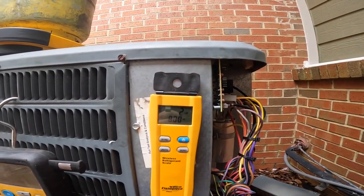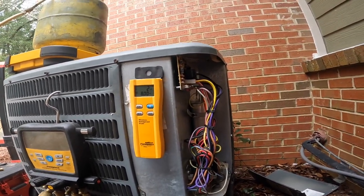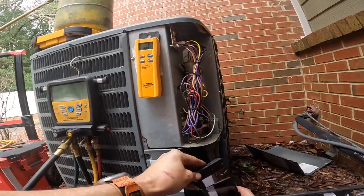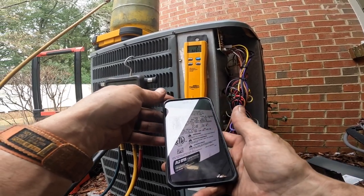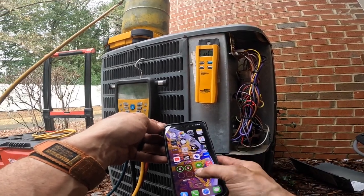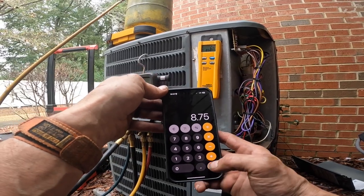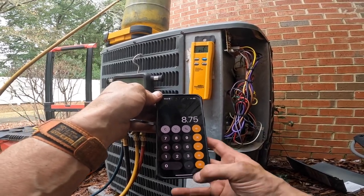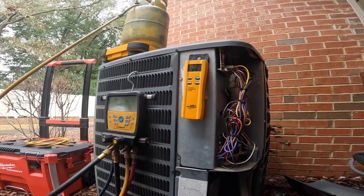We've got approximately 2.5 pounds in it. There we go, 2.5. I think it's time to turn it on. But first, let's look and see what my charge is supposed to be. 140 ounces. Let me see, 140 divided by 16, 8.75, so 8 pounds, 12 ounces is what I need. Let me go get my other drum real quick and we'll get this thing started up.